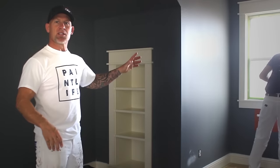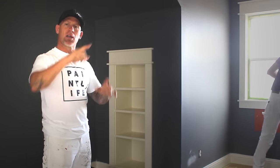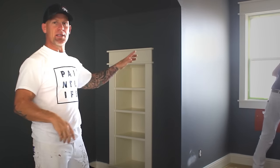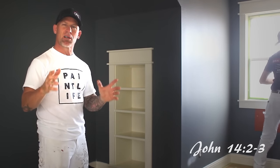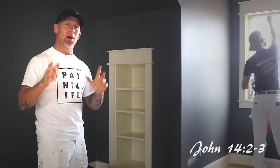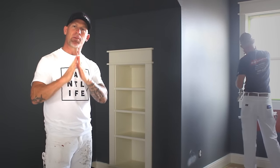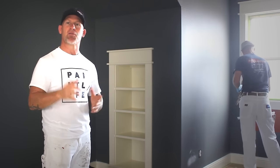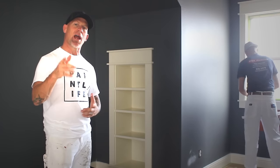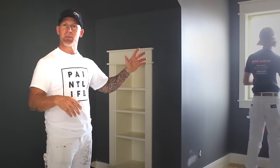Okay, we're getting ready to spray this window. We got it taped with frog tape. We typically like to take clear caulking and caulk around the tape to make sure there's no bleeding through that gets onto the vinyl windows. The frog tape works pretty good, but we like to actually use caulking also, and a lot of times there's a separation between the vinyl and the wood where it cracks, and the caulking process will fill that. So you get your tape seal and that crack filled all in one. Then we'll spray the window. While the window trim is still wet, we'll peel off that masking.